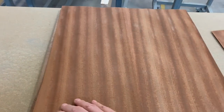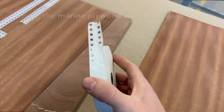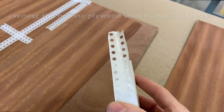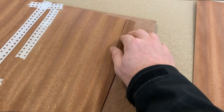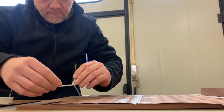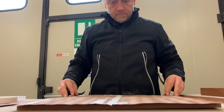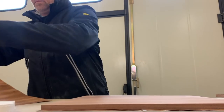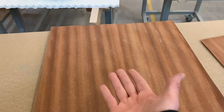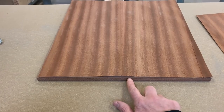After that we will paint with the original Albert Rossi color and varnish. This paper ribbon works like stamps — same glue. You should take all the pieces together before gluing. I salivated like a camel licking this ribbon — horrible taste! After much attention I combined all the mahogany sheets as precisely as possible, and in this case they will also be glued on the wooden panel, then hot pressed — in one hour the panel is ready.